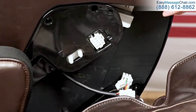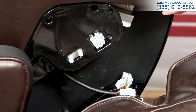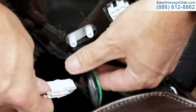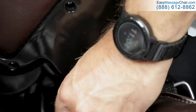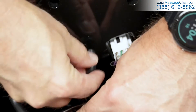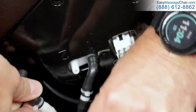On the right arm, there are two air hoses and two electrical plugs. While connecting these, line up the alignment latch and snap the connectors into place. It is important to not force these pieces together. Each plug has a different number of pins, so it should be easy to identify which pieces fit together. With the electric plugs connected, connect the air hoses to the nozzle on the arm. Make sure to connect the black hose to port number one and the gray hose to port number two. With these firmly attached, we are ready for the next step.